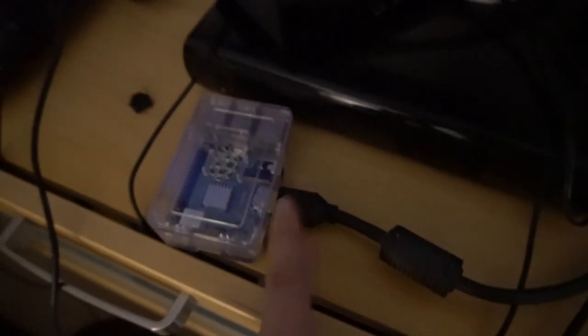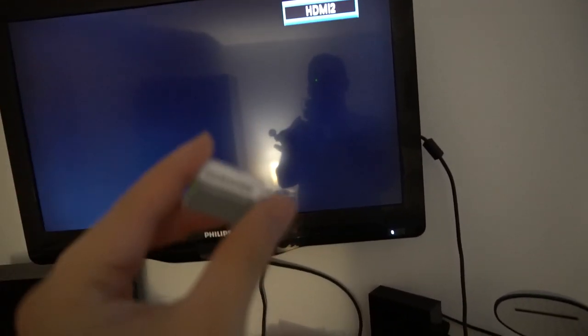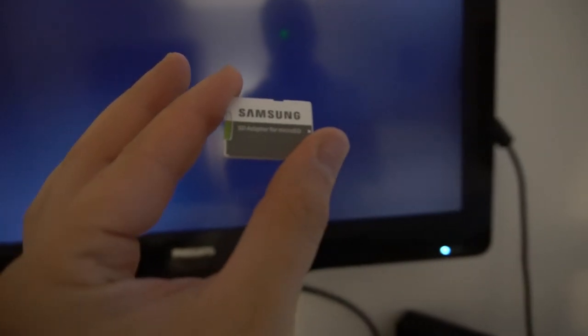This is my ghetto rig for testing right now. I have HDMI into the Pi and I'm going to be plugging in a USB keyboard because I don't have any encoders right now - the USB will act as our encoder. I set up my SD card to automatically boot - this is forced to HDMI. So if you get somebody else's SD card you might need the TV on before you power on the Pi, but on my card it's forced HDMI so you don't have to worry about that. The keyboard is acting as player one going into the top left USB slot.